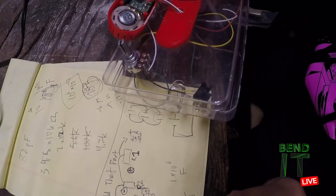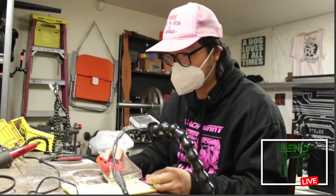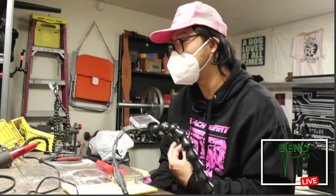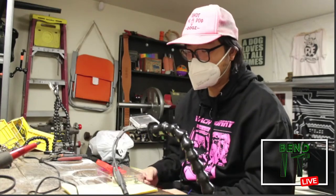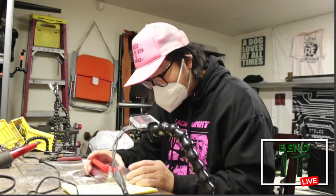Part of soldering these leads right now is to not have to do as many things when I'm engaging the bend. I kind of have to play something and hold the leads together, and it's pretty hard to touch your probe to the terminals while playing something. So if you know you're gonna want the bend, then it's good to just solder it so you can just alligator clip it and not have to mess with your probes. So I think I'll get right to that.